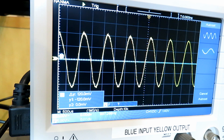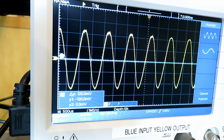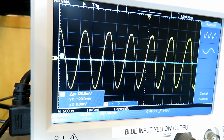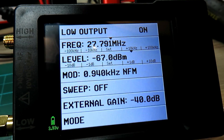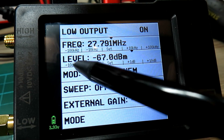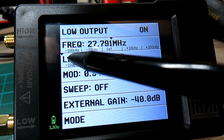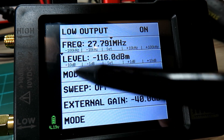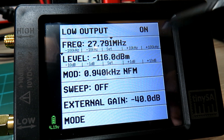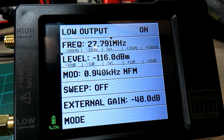We'll just peak that. I think we're there, there or thereabouts. Now let's see how sensitive it is on the SINAD analyzer meter. We're going to drop the signal right the way down - go to the meter here and start to lower the signal. That's as low as we can go.